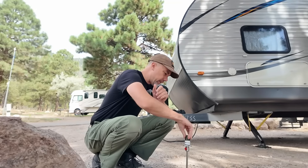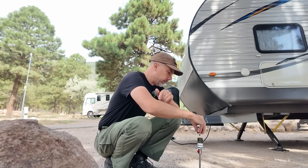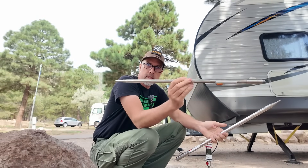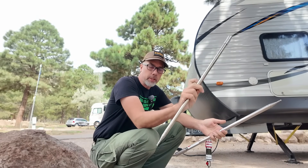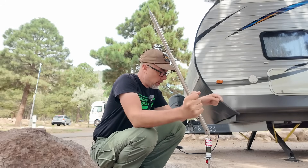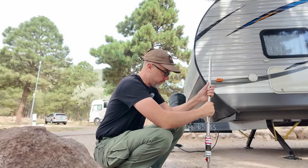On the side of the spike there's a red thumb screw — you can easily put radials under that as well. From there I'm going to put on the red coil. We've got the SS 58, the SS 17 which is 17 foot, and then the big boy, the SS 25. The SS 25 is good on 30 meters already, and adding the red coil gets you to 40 meters. That's what we're going to test out and verify today.